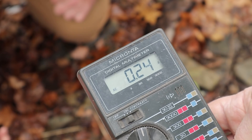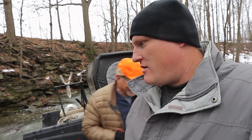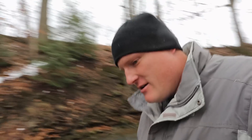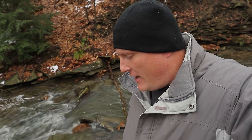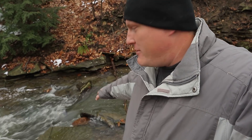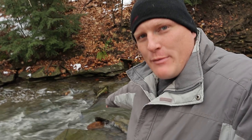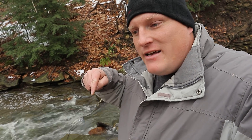So 0.26 times 14 volts — that's 3.6 watts. I got the water lily in the stream and it's clearly outputting power to a power station. It's about 3.6 watts, and that's a function of the water speed. We did what we could to get the water speed up here, and we could maybe do a little bit more to get it higher and get more amps and watts out of it. That's putting 14 volts in at 0.26 amps, so that's approximately 3.6 watts. That would definitely charge it up — it would just take a while.